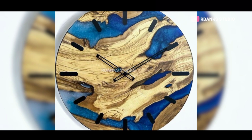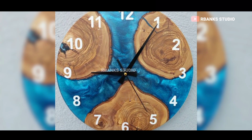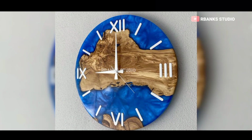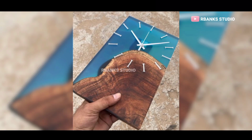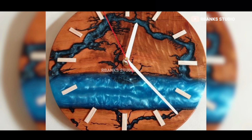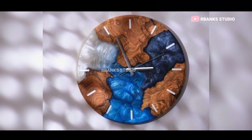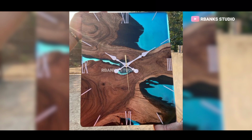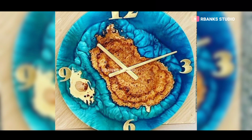Use the mounting nut or screws included with the mechanism to secure it in place. Tighten these fasteners gently. Over-tightening risks cracking the resin, undoing all your hard work. If the surface isn't perfectly flat, a small dab of clear epoxy adhesive can provide additional security. Allow the adhesive to cure completely before proceeding.